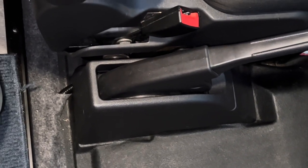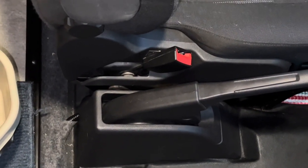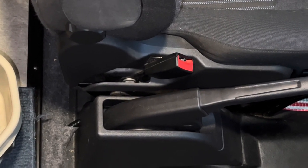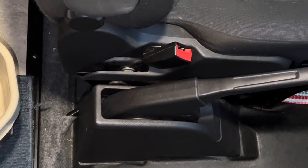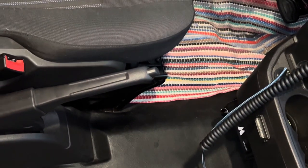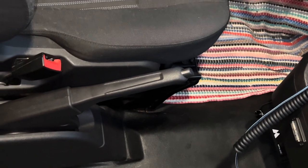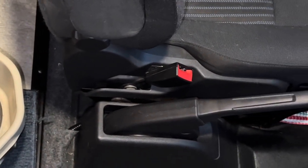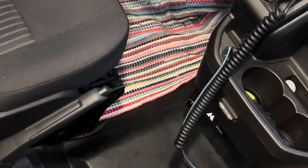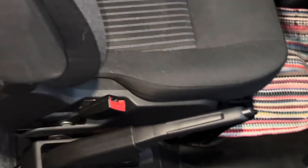What I had to do here — if you don't have a fish wire, what they use to pull wires through walls — you can use a driveway marker. That's what I used. The kind that has a little red reflector on the top. I just pushed that up through gently, take the cover off, gently push that up through to find the other end, and then you can pull your wires through. What I actually did is used a string — pulled a string back through, then connected it to the wires and pulled the wires up through. That was the easiest way I found to do it.